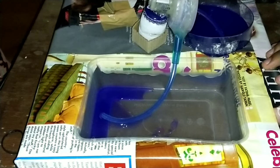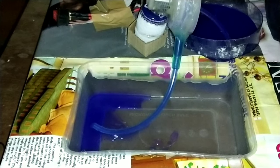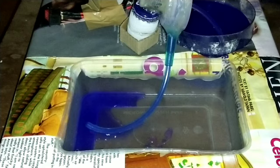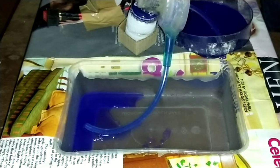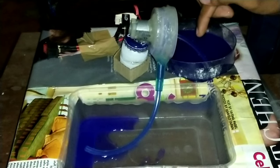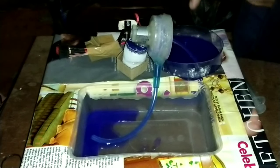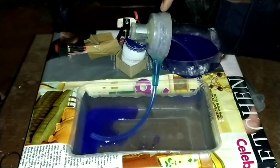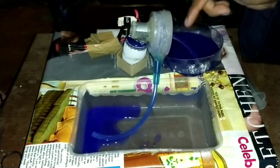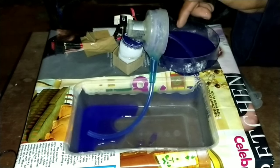Centrifugal pumps operate by transferring energy in angular momentum from a rotating impeller to the fluid, which is inside a casing. Fluid enters rapidly in the inlet, which is this hose, into a rotating impeller along its axis, and is cast out by centrifugal force along its circumference through the impeller's vanes. The action of the impeller increases the fluid velocity and pressure, and also directs it towards the pump outlet.